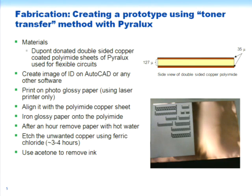So this shows some of the electrode structures that he's made. He went into a rather unusual method of fabricating these things. The idea here is you start with some insulator that has some copper on it, and then you want to do some etching and leave these structures, and then you connect your probing voltage source to these, and lay one of these structures against the cable, typically between the underlying concentric neutrals, and then you will produce a probing field that extends into the cable.